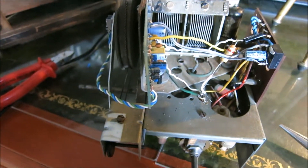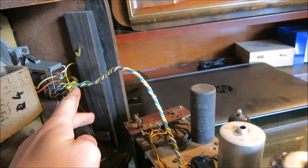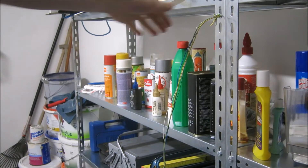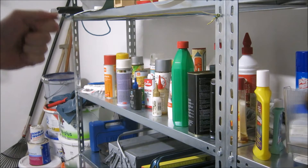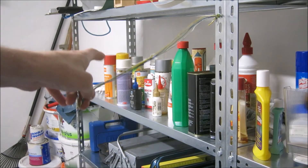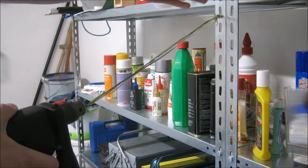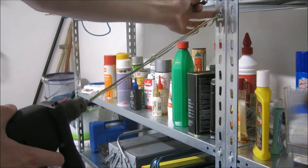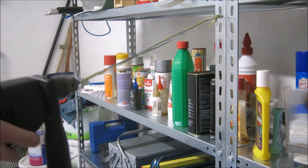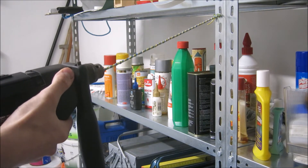Let's put this back together and see how it works. Have you ever wondered how to properly make twisted cables like these? For the lazy man, here's a good trick: tie the wires to something fixed so they don't move, start winding the beginning in a clockwise direction, and put your drill on. Cut the length a lot longer than what you actually need because you'll waste the end and the beginning, and by winding it up it will get shorter. And there you go — couldn't do it better by hand.